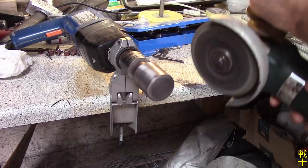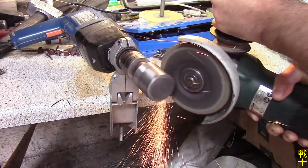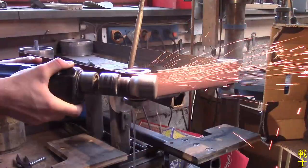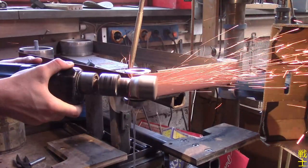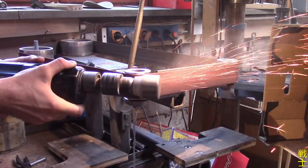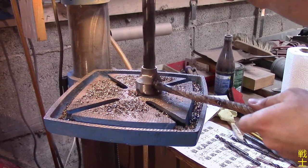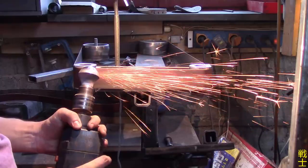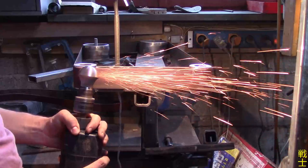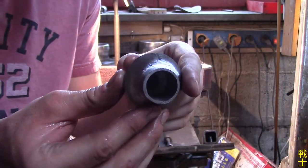With that, I made myself a very dangerous lathe and started carving the rotation symmetric shape of the pommel. While still having a flat surface, I widened the hole in the center and put the thread in a lot deeper so I could round over the flat end. Oh, and I will use that later to attach the pommel to the sword.